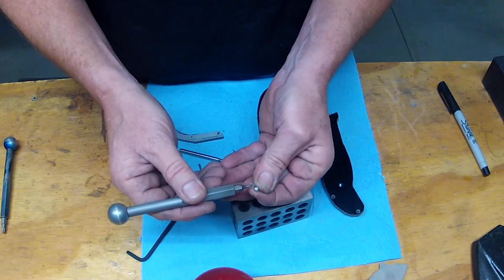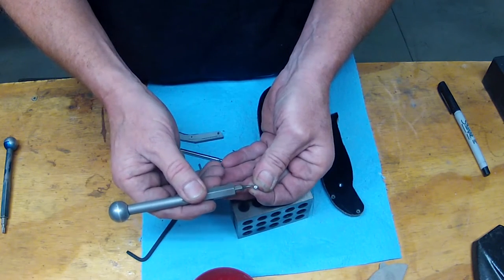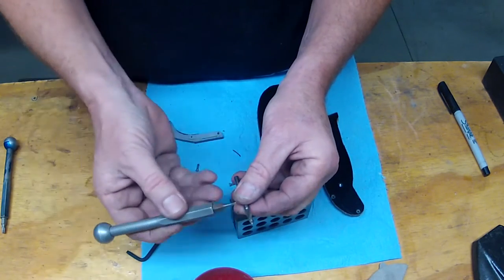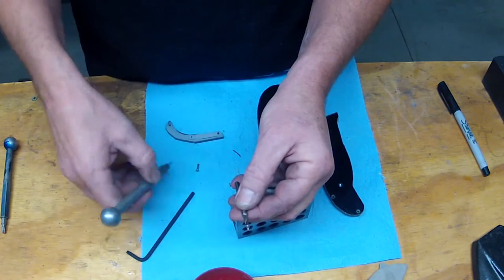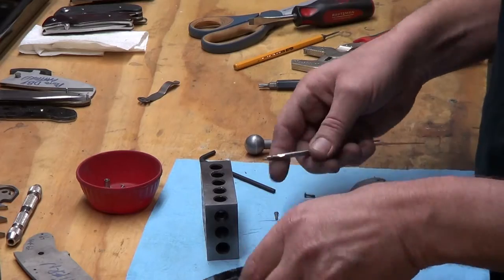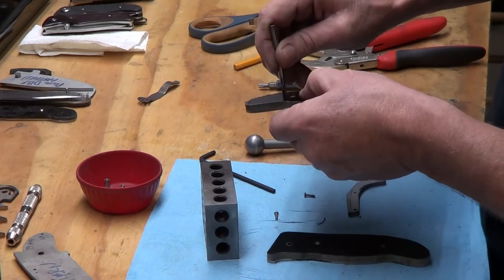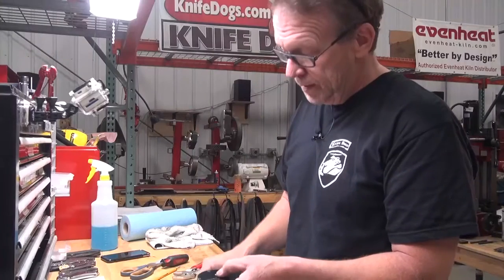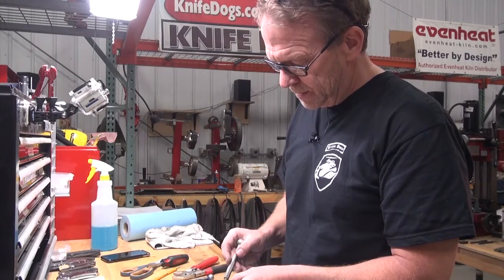Diameter on a screw is around 161 thou. Okay, the outer diameter of this is 159, so it's a real snug fit. And you get around that by just kind of, in the drill press, wiggling it around a little bit to give you just a bit more. And this material actually gives right at the hole.